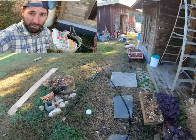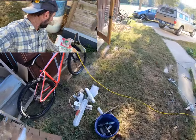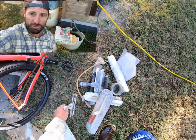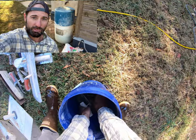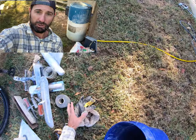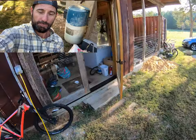This is the only lime that we can get that's locally available. It's manufactured, I think, in Alabama, which is why it's called Southern Lime. It is a type S hydrated lime. Now, if you're researching what kind of limes to use, you're gonna see a lot of debate and a lot of haters out there talking trash about hydrated lime and how it just doesn't bond and how it doesn't hold up over time. A lot of people, especially in Europe, prefer to use what's called a hydraulic lime. And that is certainly a stronger lime.